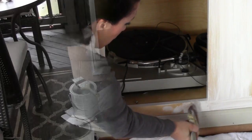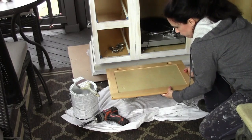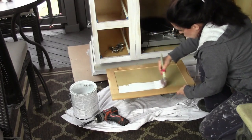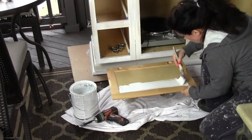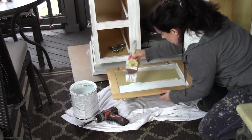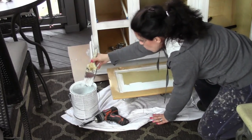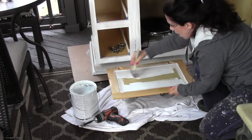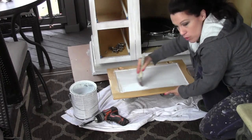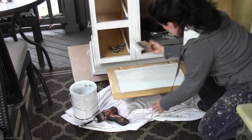Out here I had a couple of mason jars — it's usually a good idea to prop the doors up off the floor. I'll start one side first and obviously have to do the other side, so this is going to take twice as long as the actual cabinet. This coat takes about an hour to dry, but it's a cool fall day, so I'm going to make sure it dries at least two hours before I put any paint over the top. Even waiting until tomorrow is fine.